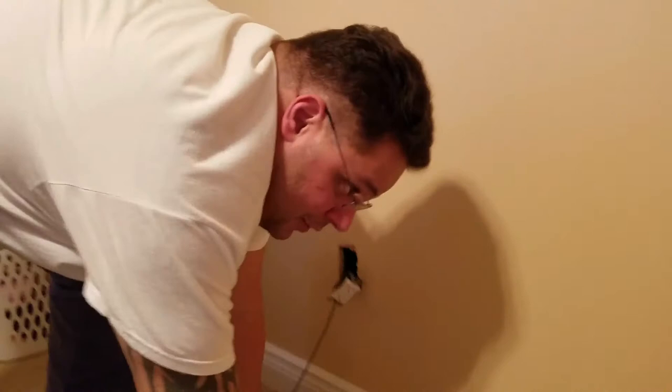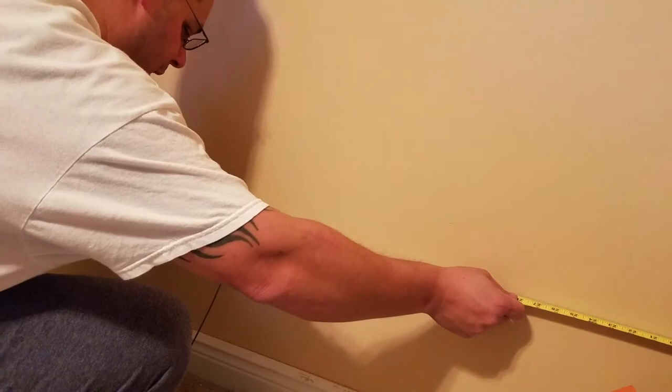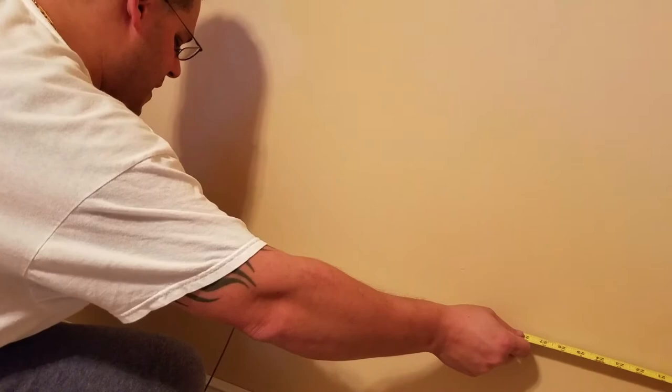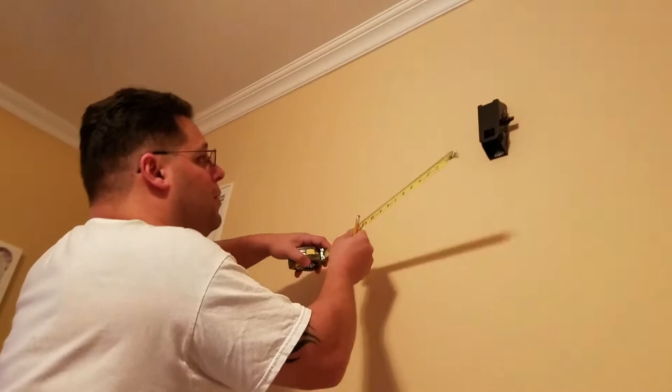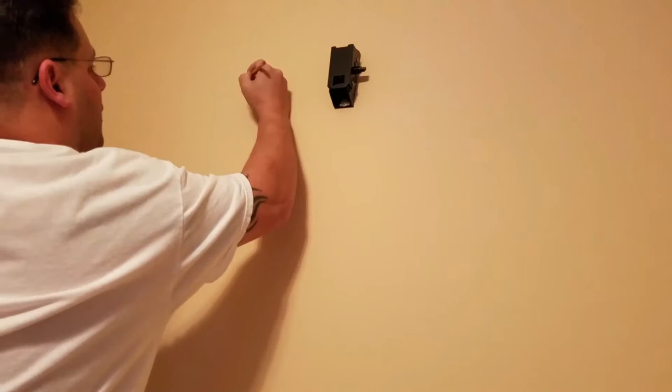I've got a plastic cut-in box — you can buy them at Home Depot or Lowe's. I already determined where I want to put the outlet. There's a beam, so I'm going to measure where the beam potentially is — it doesn't have to be accurate, just enough to know where you think it is. We're at exactly four feet, so four and a half feet is going to be where the current beam is. Just so I don't make a hole in the wall a dozen times, we'll go here. I'll mark it with a pencil. I have a drywall tool — I want to put the outlet right here. I'm going to go about an inch or two to the left.